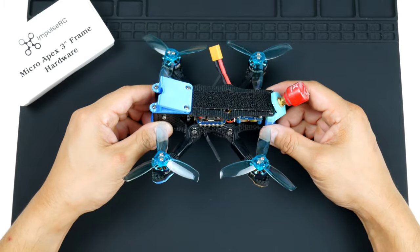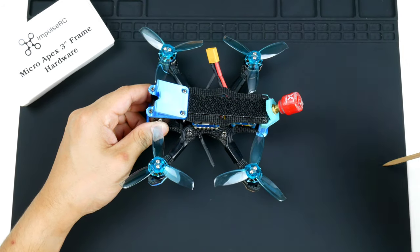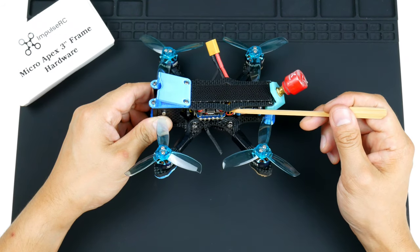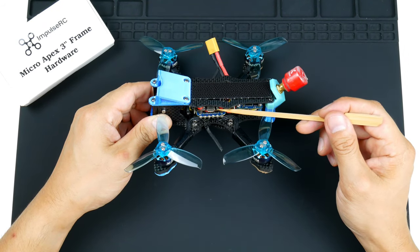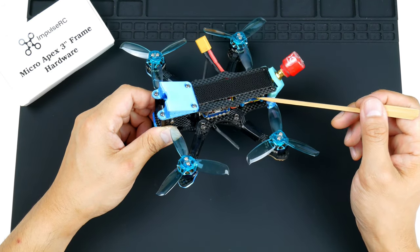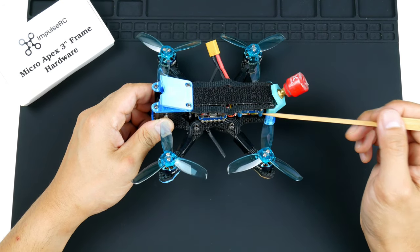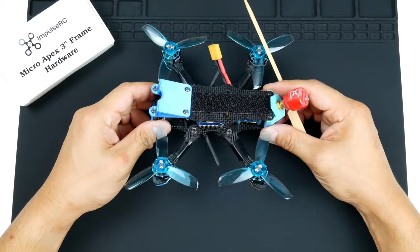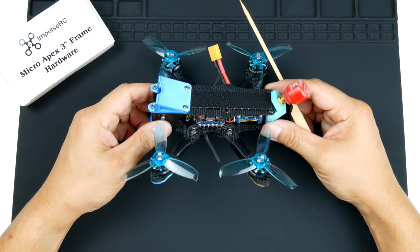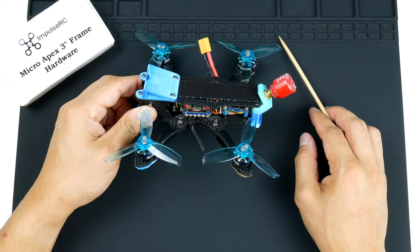What I have in here for the stack for the flight controller is, I think it's a clone, or it might even be the Furibee Mini Flytower stack. So it does come with the ESC, the flight controller, which is an F4 controller, and also a video transmitter as well. I think it goes up to 400 milliwatts, so it's actually not too powerful, but I'm not flying this thing too far away from me. It is analog. It does all right in a small space. I had to wire all that up. I will show you that through the video.